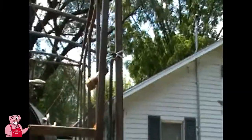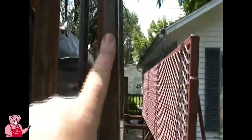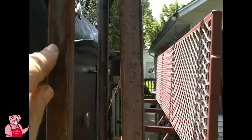Okay, because of my adding these support arms, this no longer lays flush, because the support arms are getting in the way, preventing it from closing all the way. So I do have to make another couple welds. I told you I was going to make some dog ears like this up here. What I think I'm going to do is go from the overhang here in this direction and weld the dog ears over and drill through and go at it that way.